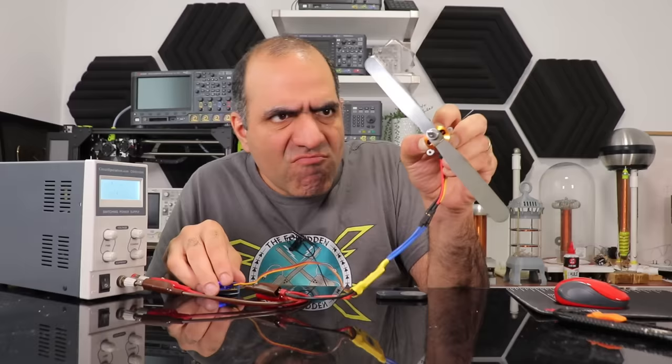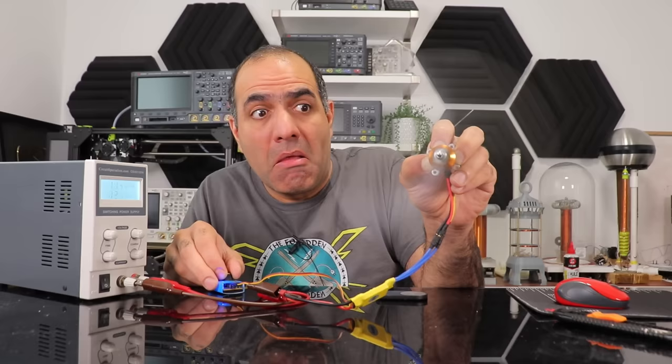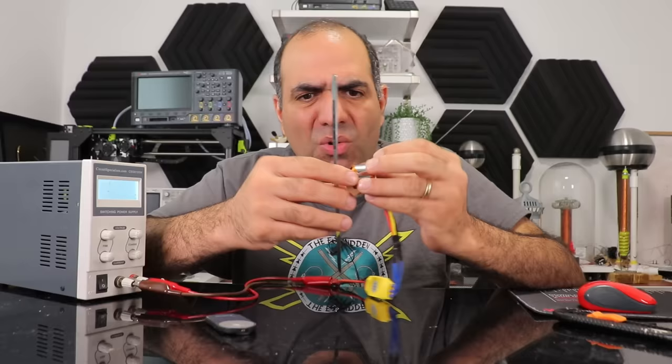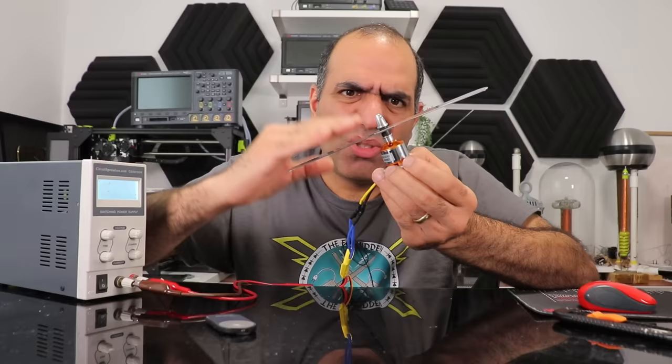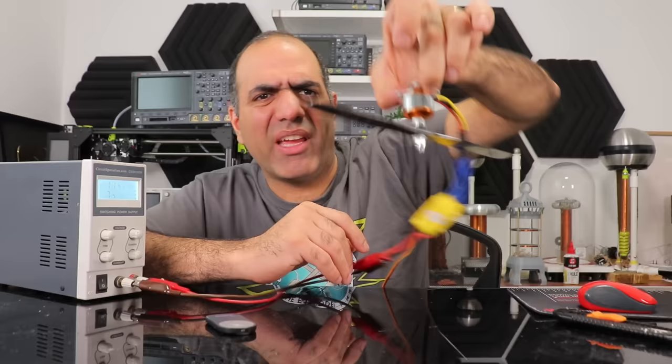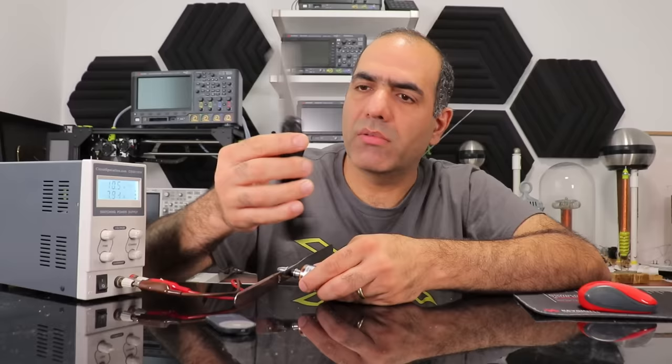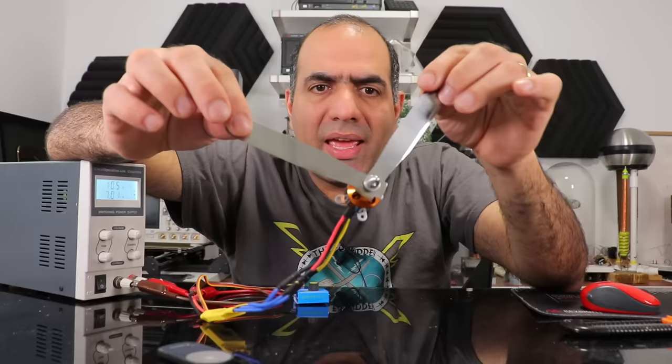This is quite dangerous, but I have to hold it much tighter. Let's start. This is not slow! And it vibrates. Well, the vibration is not huge — I think it's quite well balanced. The imbalance might be coming from the fact that I'm putting the blades on top of each other, so they are not super balanced this way. Which means I can't trim my hedges just holding it by hand — I have to make a proper housing for it.